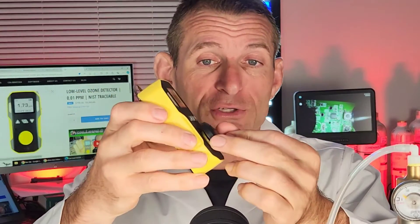If you are using it for personal use — on yourself or your employees — make sure the cap is not on there. It must be off so all the gas molecules can be detected at the front of the gas monitor. It also comes with a sling; pop it on your wrist so the unit doesn't fall. It comes with a nice color manual available on our website in PDF format, and importantly, with your NIST traceable calibration certificate.